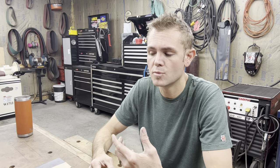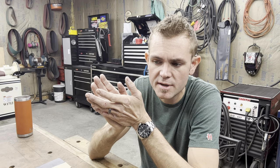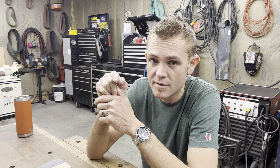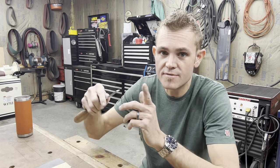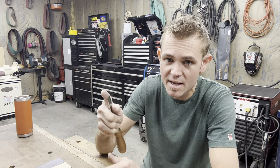A lot of people will spend an hour honing a chisel, and frankly 59 minutes of that is often wasted time. The tool's only going to hold as fine of an edge as it can hold. Every steel has limitations. To hone a woodworking chisel out to 20,000 grit, the first cut, not only is it not that 20,000 grit edge, the edge will deform and actually perform poorly because it'll have a jagged bent end on it.